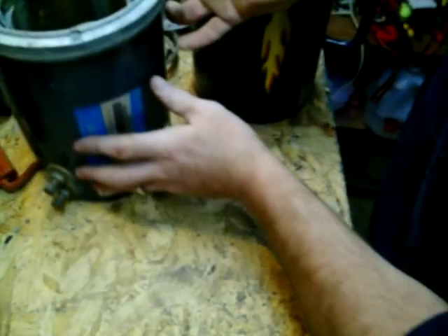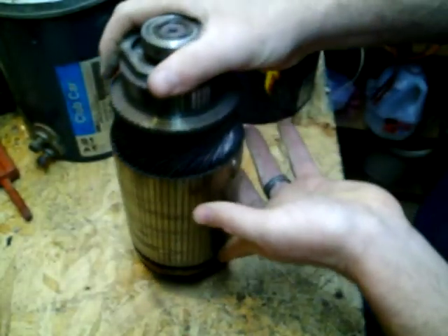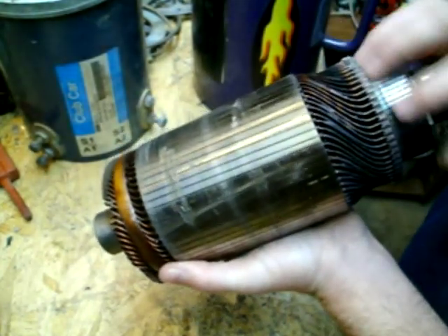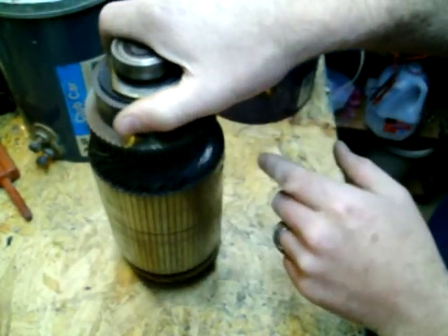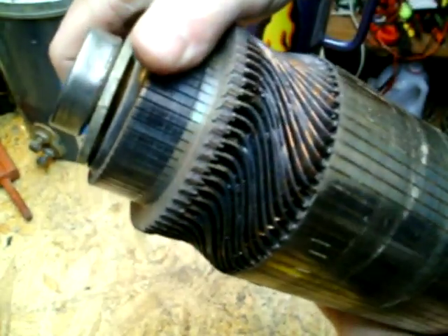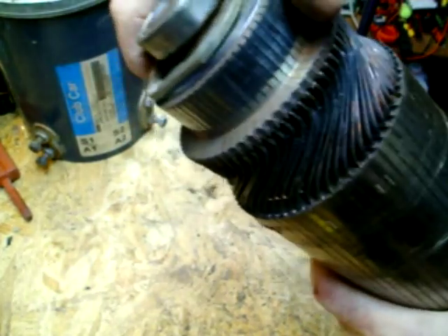As far as the armature from this motor here, it's right here — nice and shiny and clean. The comm's in pretty good shape; it has been a little hot. There's some flaking of the coating on the wires, but it should be alright. Nothing's touching, so I should be good.